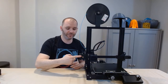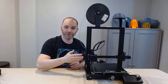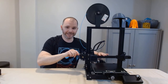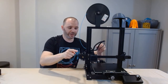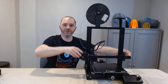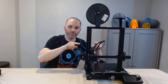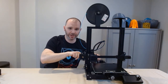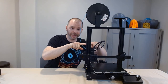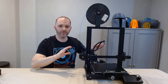One difference is right here — this cover. Voxelab has it off from the factory, which actually makes it really easy to assemble. The second difference is the screws back here, which is a really big deal. I can adjust the X-axis gantry right now as I sit. On the Creality, the screws are behind the extrusion, so the whole assembly would need to come off to adjust. Voxelab has moved the screws out front — I can adjust right from here. It even changed the fulcrum, so the pivot points are further apart, which should be a good thing long term.